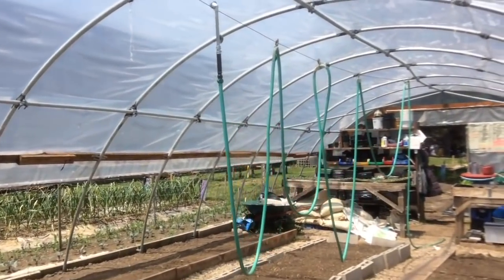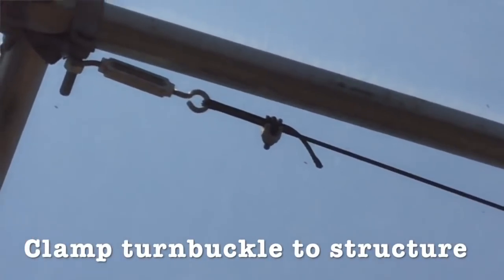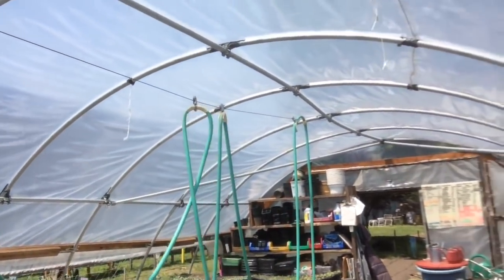This overhead hose trolley is pretty ingenious. It's a way to ensure you're not dragging the hose around and getting it caught on things in that small space — you're not tripping over it. And because it's overhead, gravity is working for you: you're not holding that weight on your shoulders and you can just freely move around with this hose. It's simple to put together. Basically it hangs from the ceiling — you string up some cable between two ends in a straight line, thread on some stainless steel pulleys so they don't rust, attach the hose with hose supports, and when you move it you just tug gently and it moves effortlessly.